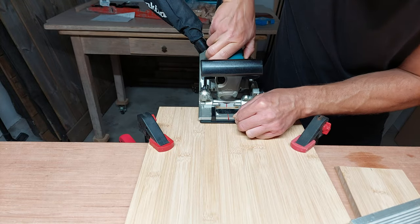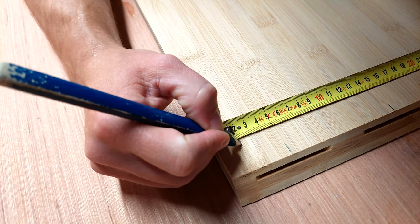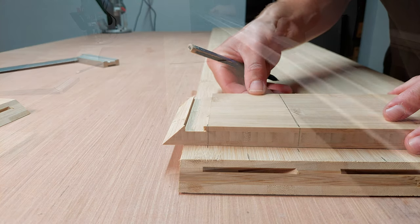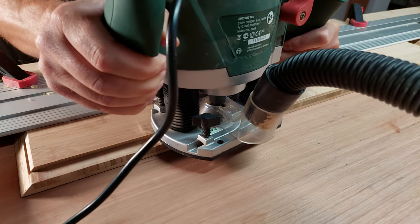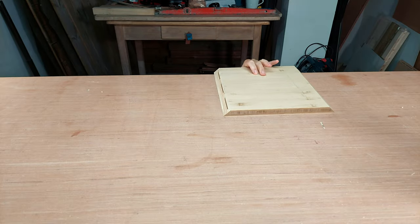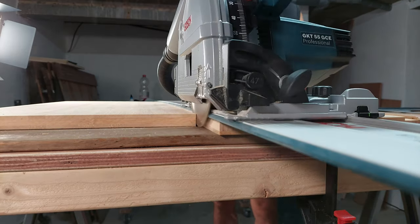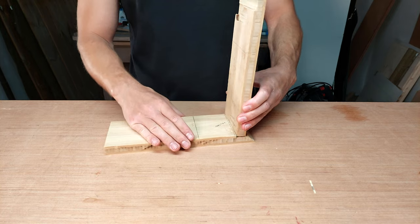With a fairly straight-looking angle and an acceptable gap, I pumped myself up for a joiner marathon that lasted for months. After months of grueling work, it was finally time to work on the rabbet for the back panel. I want this panel to be recessed one millimeter more than its thickness to ensure I can pull the cabinet tight into the wall during installation. I made another test piece, quadruple-checked my measurements, and went on it. After milling out the rabbets I could measure up the dimensions for the back panel and cut it to size. Another testing block verified the biscuit joint, so I continued my marathon on the back panel as well.